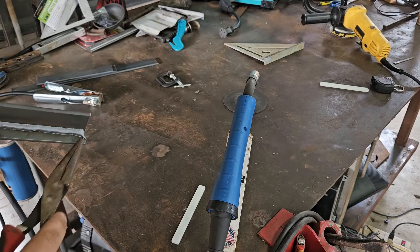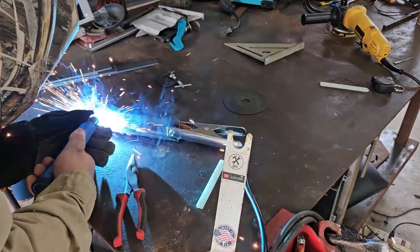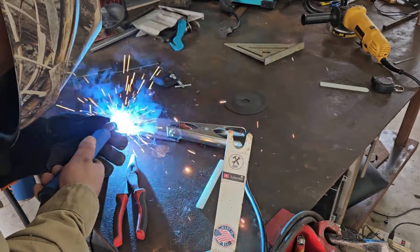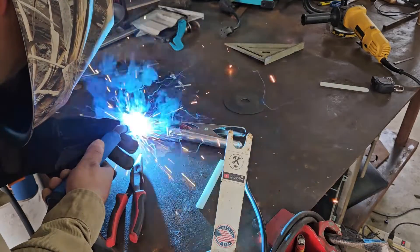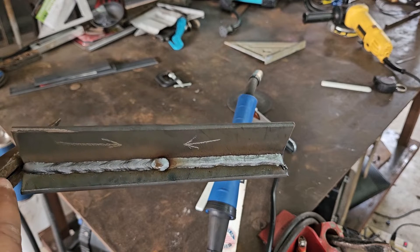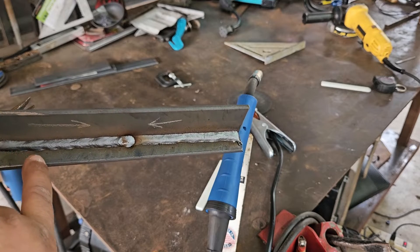At the beginning there was a lot of popping, so I tried to adjust the wire speed. I kind of like the way the push came out — this one started a bit cold here, not too much heat on the bottom. My movement speed kept changing; I was going fast, then slow down, then fast again.